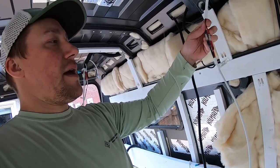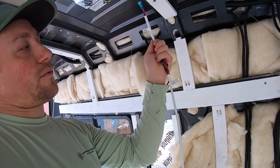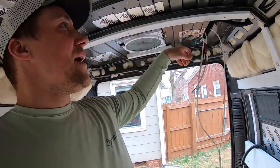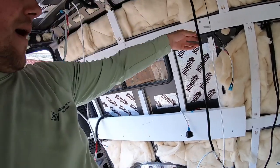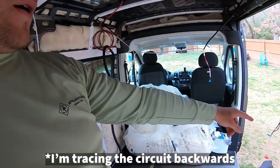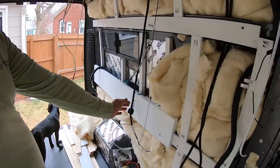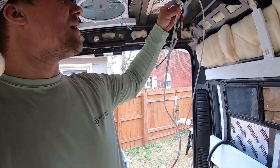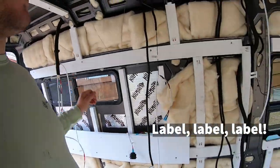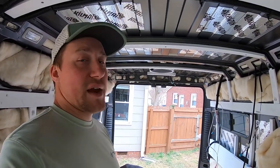These are our lights - I labeled every cord. Here's light number four, and cords like 'bed lights number three to number four' because we're going to have four lights. It's basically a circuit that runs to the back side for two lights, back around for two more, down to the switch at our bed, and across to the second light switch. We'll have a light switch at the doorway and one at the bed. I strongly suggest labeling everything - it makes your life a lot easier.